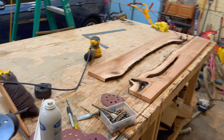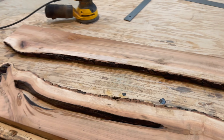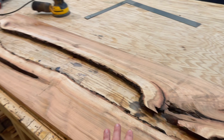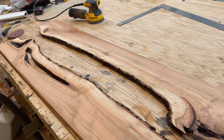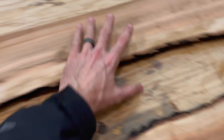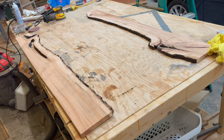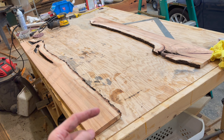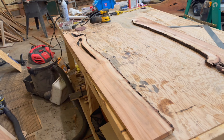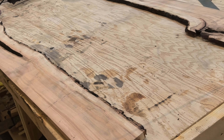This one being 30 inches can strap across two studs without any problem. I might grab one that only does about 150 pounds — this mirror when all is done is probably only around 40 pounds, so it'll be way overkill. Depending on the size of your mirror and thickness, the glass does weigh a lot. If you spread this out clear and put a large piece of glass mirror between to take up more space on a wall, you're going to need more support, and may also want steel support straps in the back bridging behind the mirror.